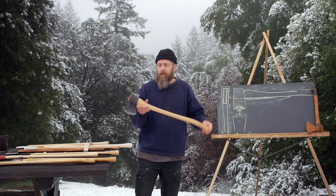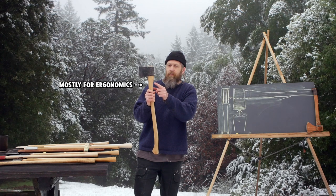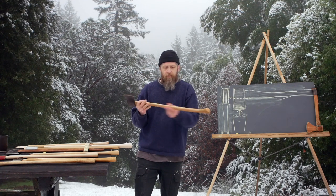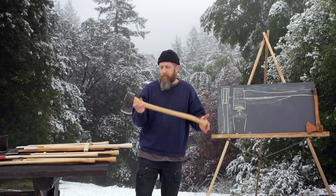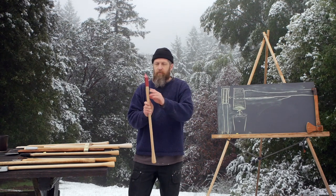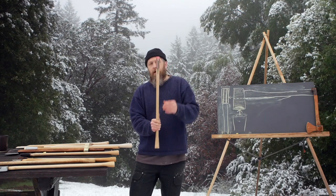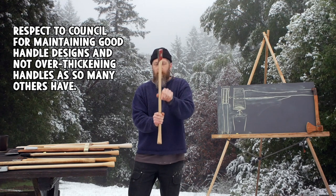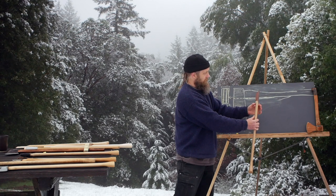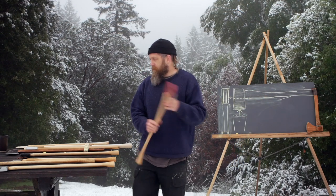With this handle I didn't have to do that much — I took quite a bit off here, quite a bit here, and a lot right in this area because it came out much further than I wanted and then dropped down. None of it was a ton of work. This handle came close to what it should be in the first place. Pretty much any new axe handle, unless a company is doing a bunch of finish work, will have these rough cuts and transitions. This is a Council Tool axe and they actually do quite well with this too. I don't like the excessive thickness — that's going to come down. I'm going to change the differential in thickness and smooth the transitions, but they're really not that bad on this axe. You should still smooth all that stuff off when you get a new axe.